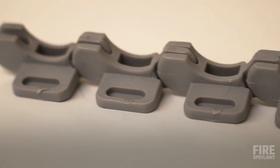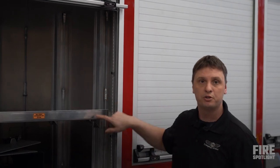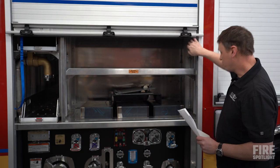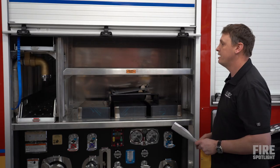What's important is you have plastic shoes on the ends of these doors that rub in these tracks. So if you do have dirt and grime, it can wear those shoes out faster. When you re-lube these tracks, you want to use a non-petroleum-based product, such as a dry silicone, for those sides.